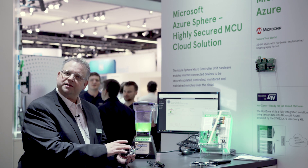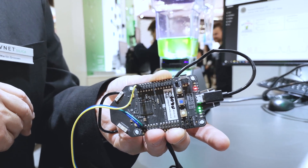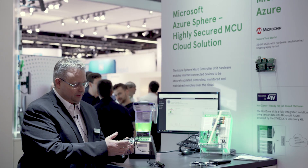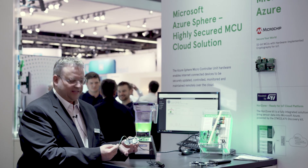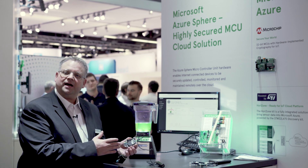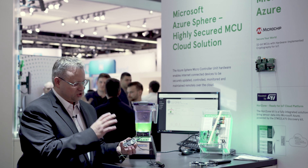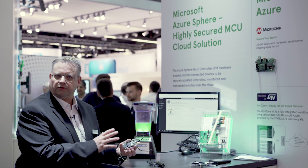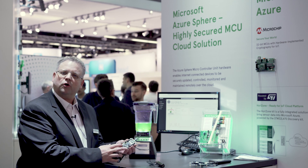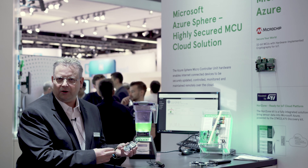On the outside we have connectivity for GPIOs, UART, serial ports, I2C, and a lot of pins to connect sensors and actuators for the IoT world. Inside the chip, everything is handled — all the security, all the chip authentication, the hardware root of trust, the trusted layer security — and the data is sent over the Wi-Fi connectivity to the cloud directly.